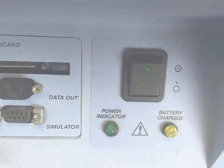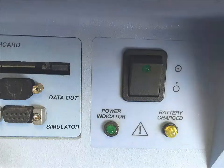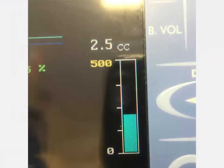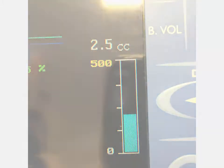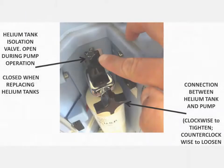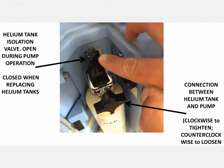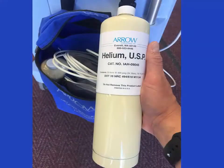At the base of the pump, locate the power switch. Determine helium level by the electronic gauge in the lower right-hand corner of the screen. When the indicated helium level gets below 100 psi, it is a good idea to change tanks. Verify that you have access to a spare tank — there is usually one in the utility bag attached to the pump.